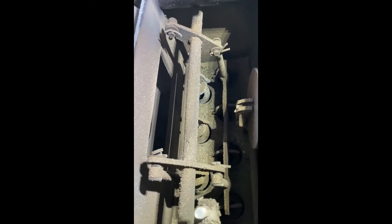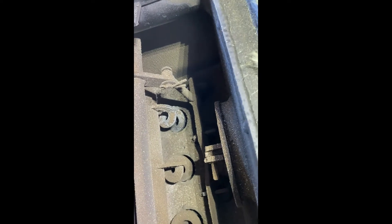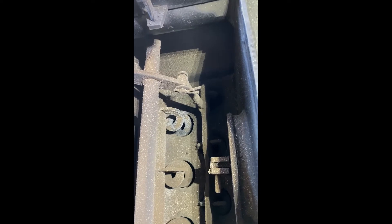What I've done to my other boiler is remove everything from the lever — the shaft, the whole assembly, and these two lift arms. The turbulators themselves stay in there because you need those for heat transfer; they slow the flow down through the tubes. But they can be removed much more easily for cleaning, and with all that mechanism out of the way, you can simply slide them straight up and out.